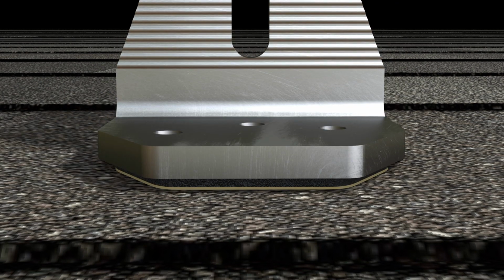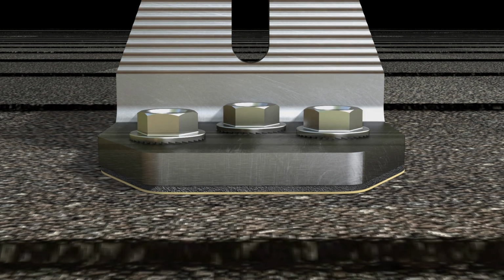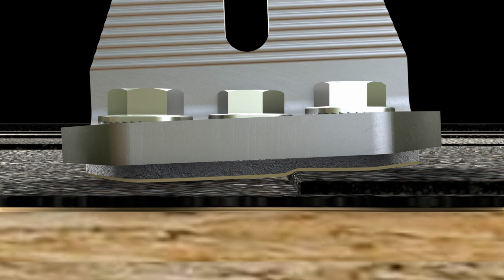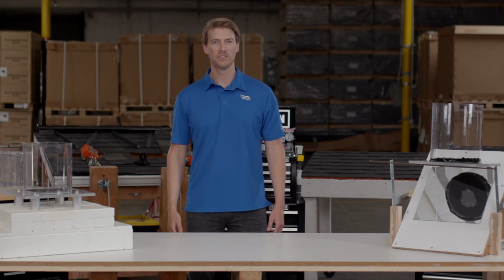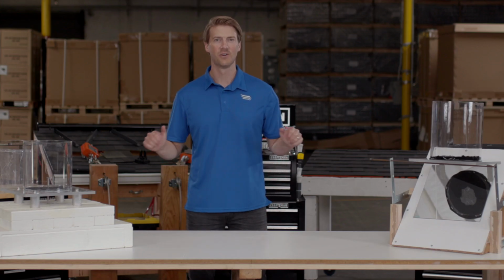Butyl tape, mastic, EPDM foam, and EPDM rubber can seal the flat part of a shingle. But when a fastener is installed at the change in shingle tab height, that butyl tape or EPDM often doesn't actually conform to the inside corner of the tab, leaving a vulnerability for water penetration to the fastener. While competitors focused on sealing at the shingle overlaps, and many failed, this isn't even the worst case scenario. They missed the mark altogether on what to solve for.